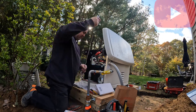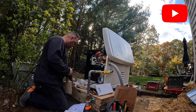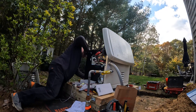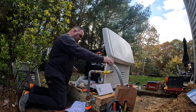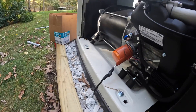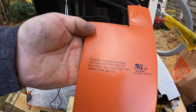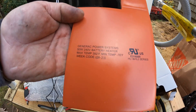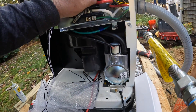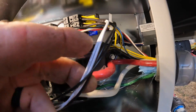Here I'm reading the directions for the battery heater and the oil filter heater that we ordered. When it goes below 32 degrees there's a built-in thermostat that keeps the battery and oil filter warm. I just connected the cables for both heaters. These are 240-volt loads — the battery heater is rated at 50 watts at 240 volts. These wires get their power from the utility power sensing contacts at N1 and N2.